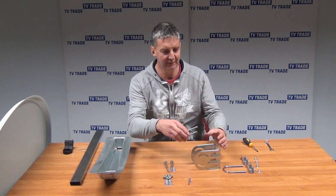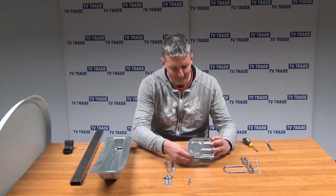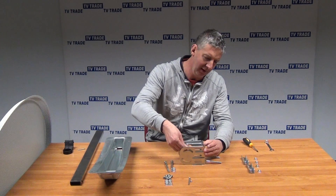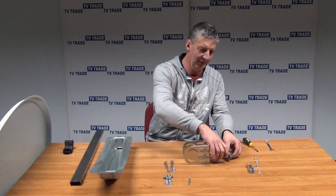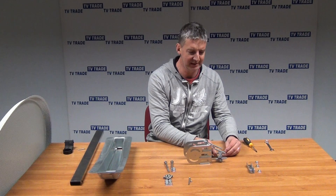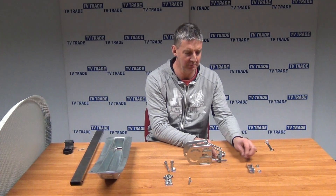So what we're going to start off with is the elevation bracket here. I'm going to slot through this large U-bolt. The idea of these U-bolts is they're going to go on to these anchoring bolts behind it, and what it means is that we can come along and bolt onto a large mounting bracket. The typical type of bracket you'd be using with this would maybe be a 2-inch galvanized heavy-duty bracket.